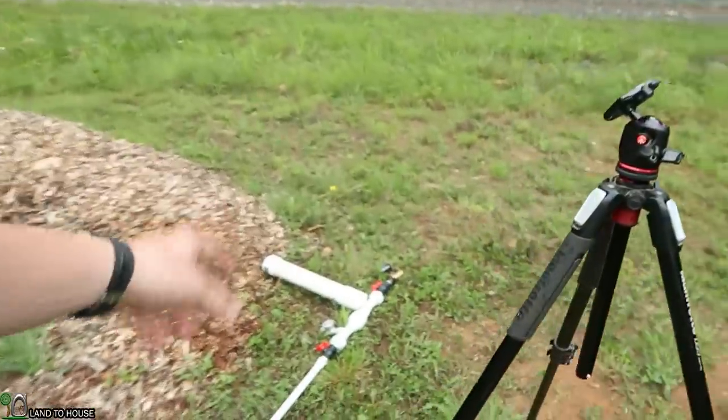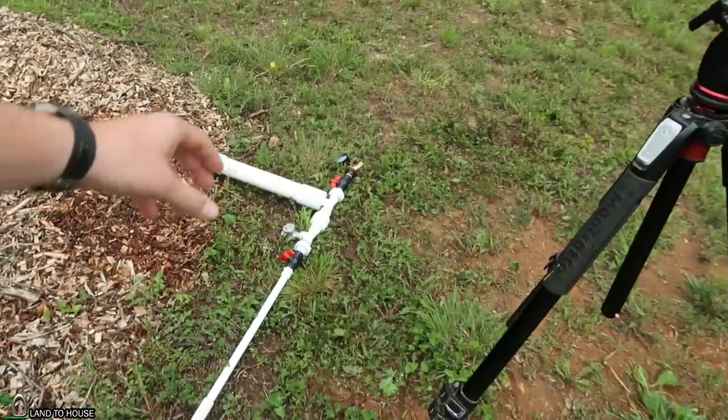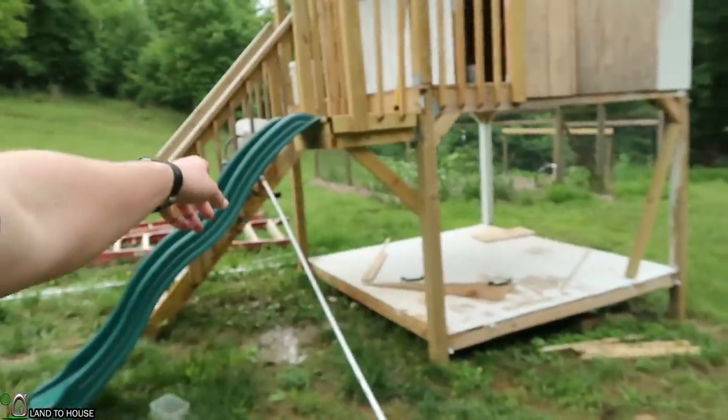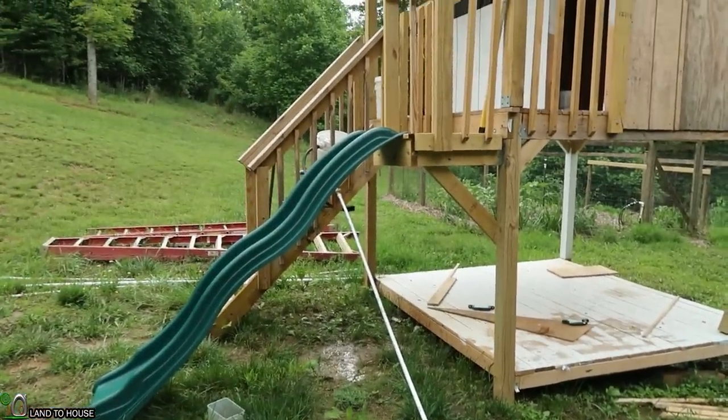So to be honest, I'm seeing no change in that setup. It looks like whenever you have a non-return valve at the very base of the pump, there's no drive pipe for the pressure wave to travel on and therefore nothing happens. But if you put it up here at the top, you do have that pressure wave and it works exactly the same. The rain is here — I've got to get the camera back inside. If you have more questions like 'will a non-return valve at the pump work,' write those in the comments below. And if you need a ram pump, check out the links in the description below. Thanks for watching. Bye.